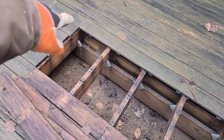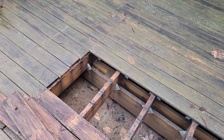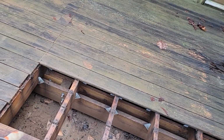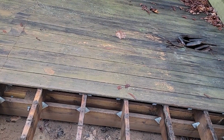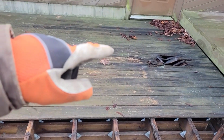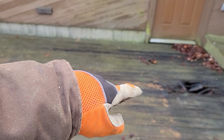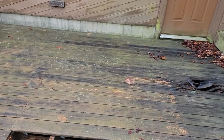I took a saw and I cut across here, but I probably should have gone a little farther because I'm going to want to get them 2x8 joists off the 2x10 header, and I'll probably end up reworking this whole thing. What I don't like is out of the door, you got about a 5-inch step. You come over and you got about a 9.5-inch step. Come over and go up about a 3-inch step to the garage door,